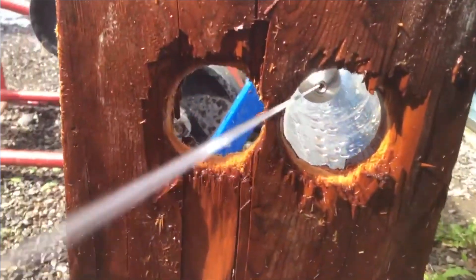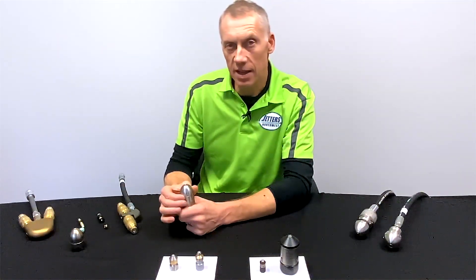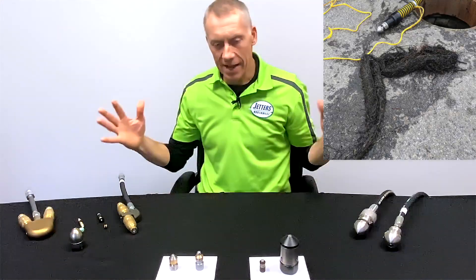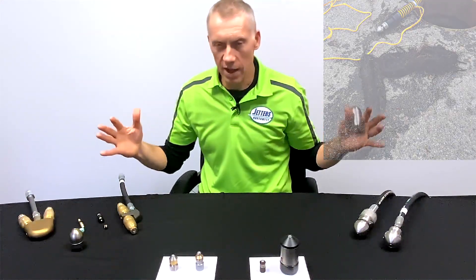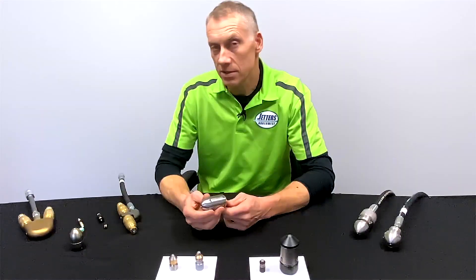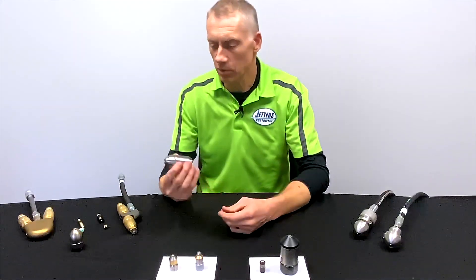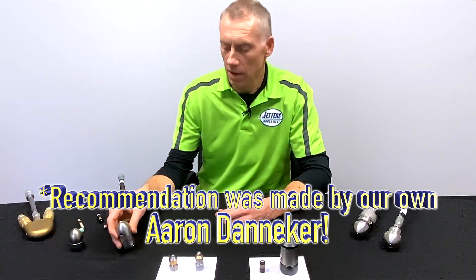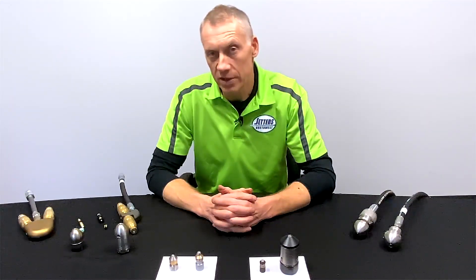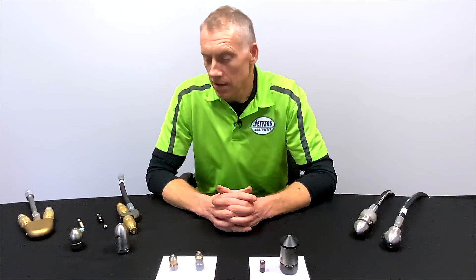I'll give an example. When the Reaper first came out, a customer had about 40 feet of pretty compacted roots in a four-inch pipe. He actually hacked out a three-foot section to show us. He didn't have any downstream access to go upstream and go after it — he had to go in each direction. We recommended he try the Reaper forward cutter. He expected to be on the job for the better part of a day, and he had a 12-gallon-a-minute jetter. He was done in about 40 minutes, going about 20 feet each direction. That got our eyes open to the potential of these nozzles.